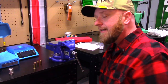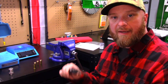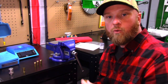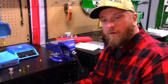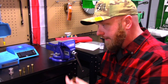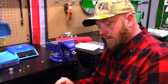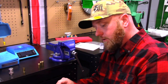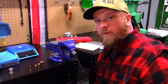To confirm my sizing die, I'm going to check the case diameter. The spec on these is 0.425 inches. These are all measuring 0.423 — this one's 0.422. We know that when we size, we typically undersize a little bit, and that builds in neck tension for our bullet. I'm seeing a good consistency in my sizing die. Looking at the overall length, these should be 0.992 inches. These are all measuring 0.991 and a half — so these are all good to go. We know our sizing die is set up correctly.